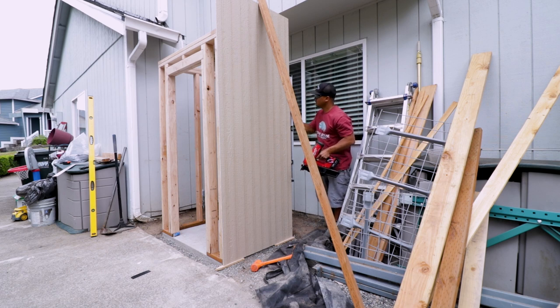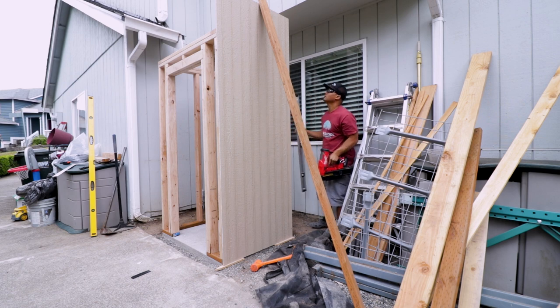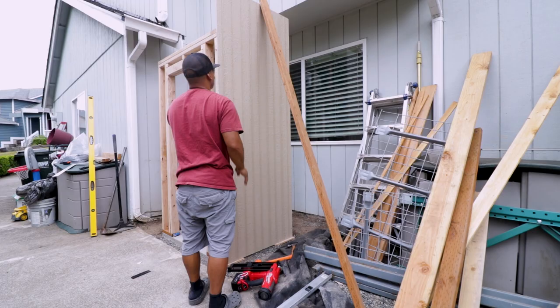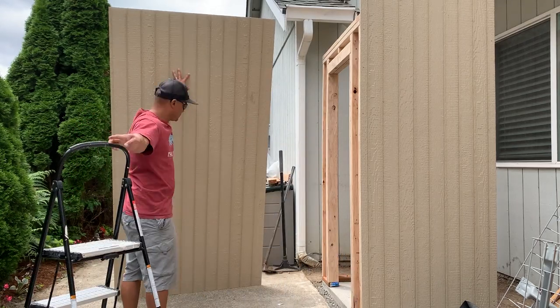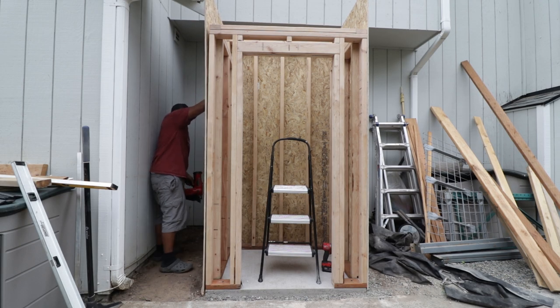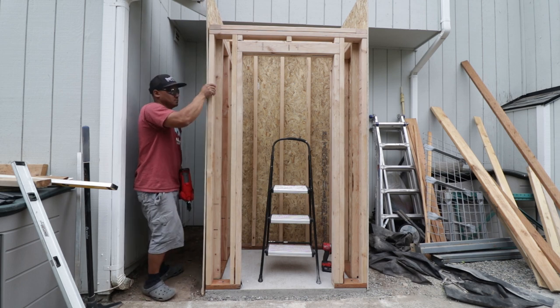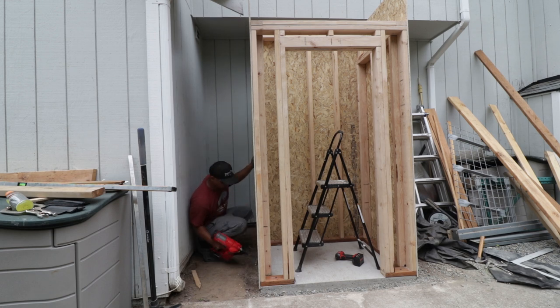The bottom overlap will keep water from running down the shed walls onto the shed floor. I started with the right side first and made the sheet flush with the lower corner of the framing, then nailed in my first nail at the lower right corner using two-inch galvanized nails. I then pushed and pulled the upper corner of the framing wall until it was flush with the top corner of the sheet, then installed the second nail at the upper right corner. I moved the top plate so it was parallel to the top of the sheet, then nailed in the third nail at the upper left corner. These steps are super important as they make the wall square and lock it in place. Once the siding was attached at those three points I nailed in the rest into the studs, then installed the back sheet, the left sheet, and the door sheet last.